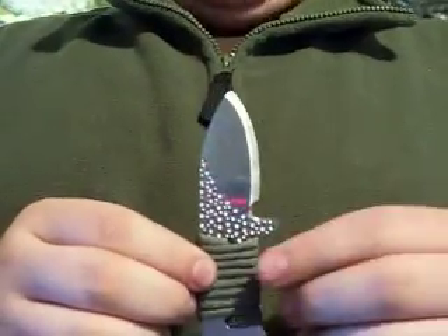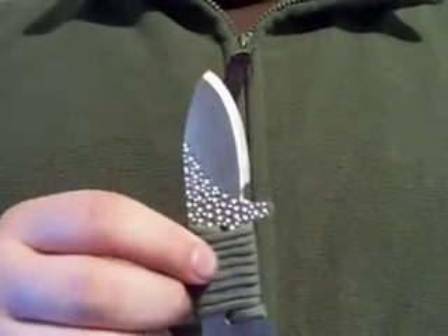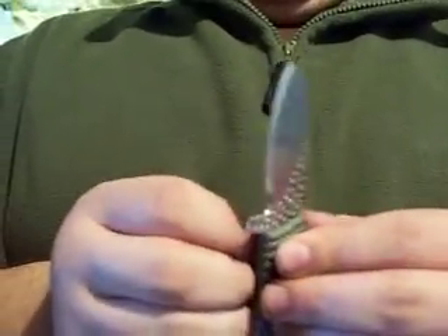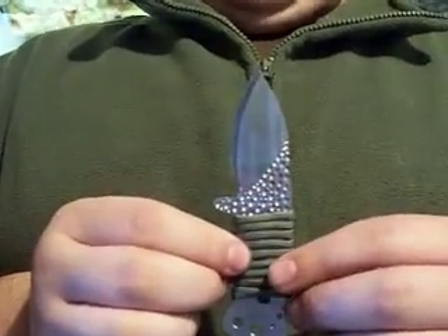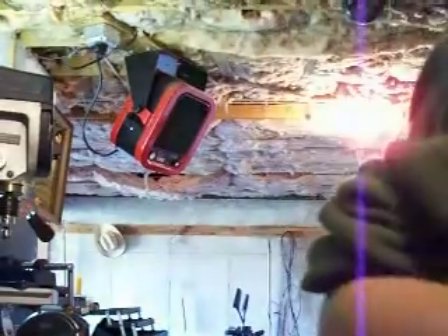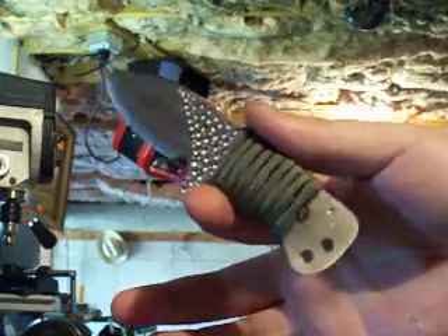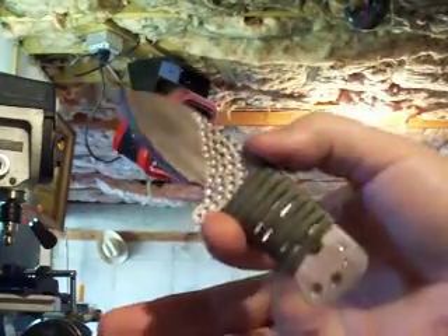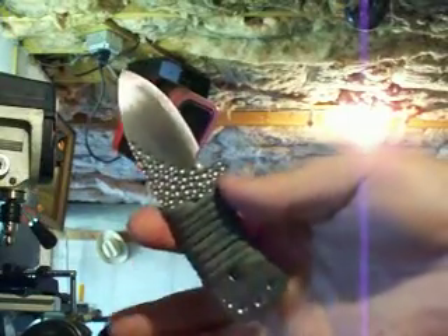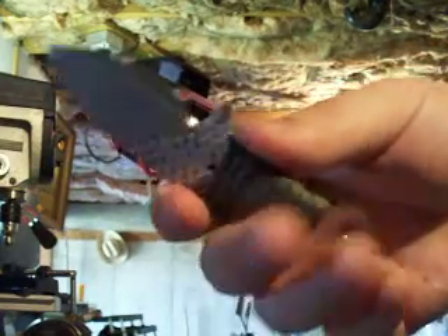Not really polished or anything, but I used an 80 grit sanding belt on the belt sander just to get a nice finish. I like it — I think it came out good. This is what I want the finished product to look like. And again, you can see I put another wrap on there just to get an idea of what it's going to feel like. So basically this is what the knife is going to pretty much look like when it's all done. All I have to do now is heat treat it and then make sure I get that finish on there again. I think it came out really nice. I like it a lot.